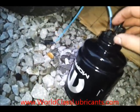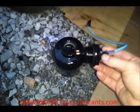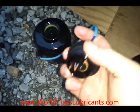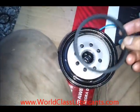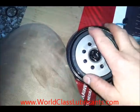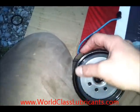The next thing you need to do is remove this piece off the old filter — this is the water and fuel sensor — and install it on your new filter. Once you have it off, you'll see there's an o-ring on it. The new filter comes with a new o-ring, so make sure you pull the old one off and replace it with the new o-ring, then install the sensor on the new filter. On the other side, the new filter comes with a thicker o-ring — just install that and get it in place.